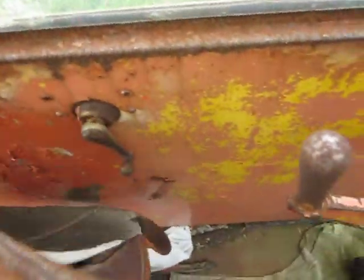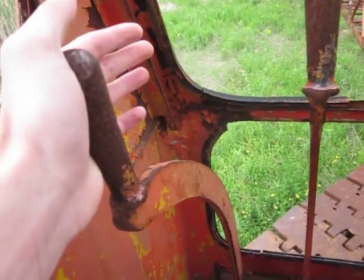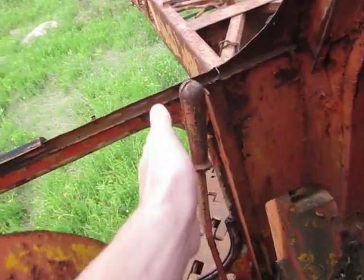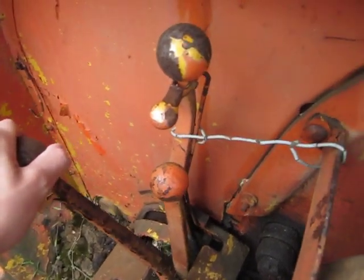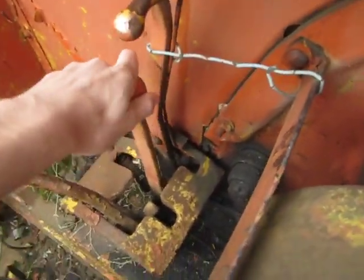Out here, let me take a seat — this is your control setup on the unit. This is your reversing shaft; it controls your swing, boom, and travel functions. This is the drag, this is the hoist, and this is your master clutch. This engages either the travel or swing — pull it back to travel and push it forward to swing. This engages the boom: pull it forward to disengage, pull it back to engage.